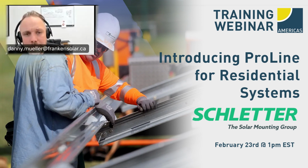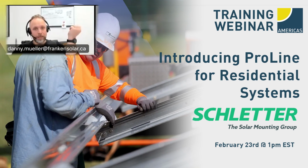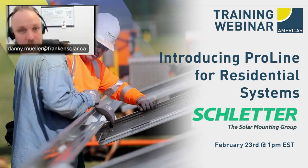So the bonding screws aren't needed then? No. It's just literally like you have a rail, and you have a splice. You stick the splice in there, and then you take the other rail and stick it in there, and that's it. There's no components. It has a little metal piece basically that goes counter to the rail. So it goes in, but once you put in the splice, it's almost impossible to remove it. So it's really easy to work with. So for installers, it'll be quite handy.